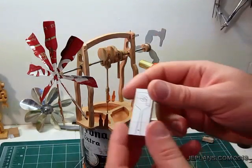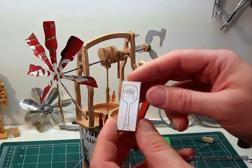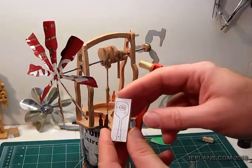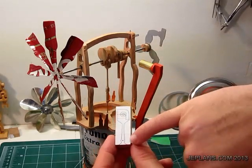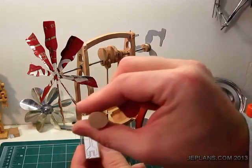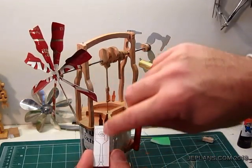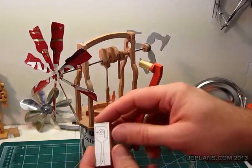The new piston drive is going to require a new connecting rod. I have the plans for that here - this will be cut out on the scroll saw. I am going to skip the part that would allow me to remove it from the crankshaft and just drill it out to allow for a bearing in there. Initially I will cut this side to about here, then cut out the piece that attaches to the back, then cut the sides up until this point, then finish cutting out this side. First I will cut out the back, then the front, then remove the whole thing.